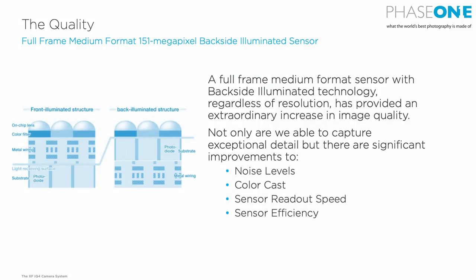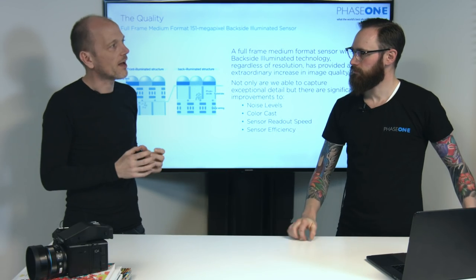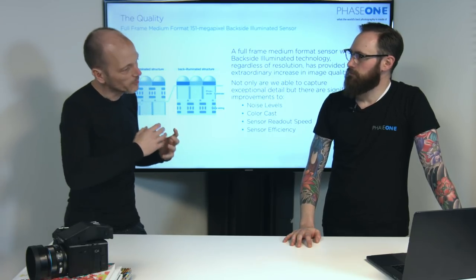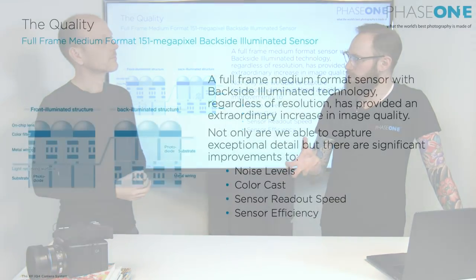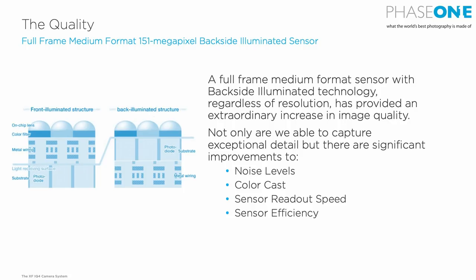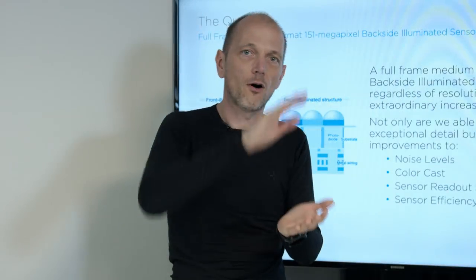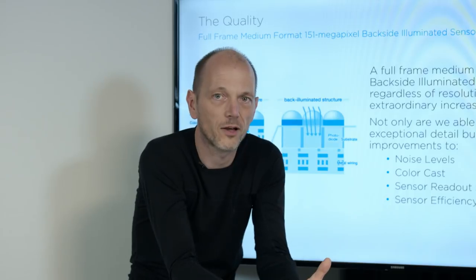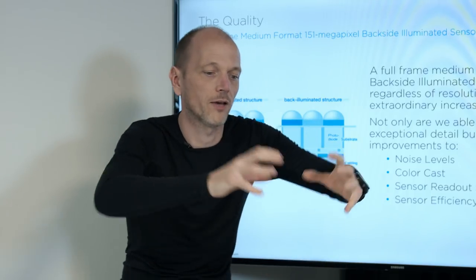When making image sensors of higher and higher resolution, of course the pixel gets smaller. And to counteract the decreasing image quality, a number of technology advances has been developed. BSI is a very significant new way of manufacturing sensors to make sure that image quality keeps on increasing — it's a completely new way of manufacturing sensors. To give a brief explanation, we start out with a slice of silicon. Inside this and on top of it, through a very elaborate process of printing and stenciling and etching, a number of layers of electronics is built up, starting with the pixel well itself, which is underneath inside the substrate because it has to have a certain volume.